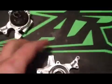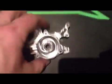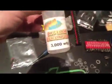I'm just going to drill this out a little bit — mill out a tiny bit in the middle — and be very careful not to go too far. Then I should be able to get the four-mil bearings in. That's been milled out now so it should take the 16mm bearing — just trying that in there. Seems to have gone in nicely. Now I've just got to rebuild the diff, put on the new seal, and fill it full of 3000-weight oil and crack on.